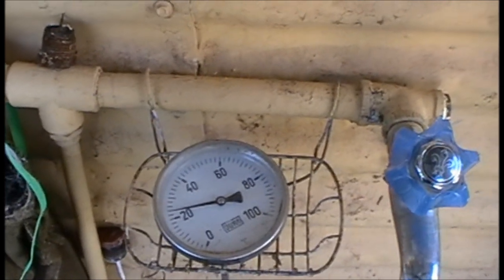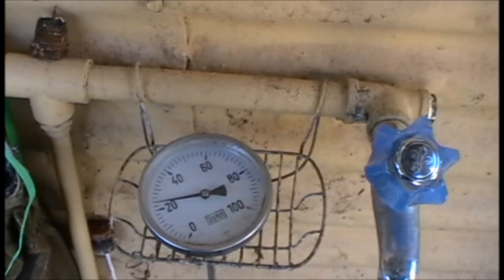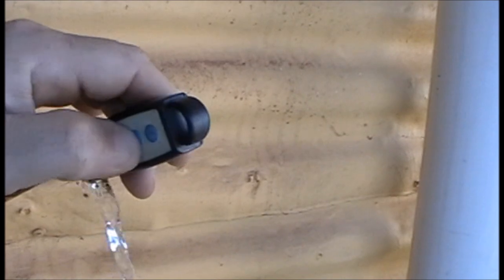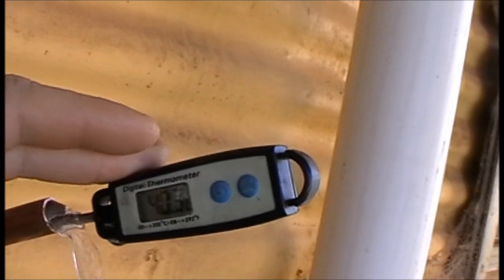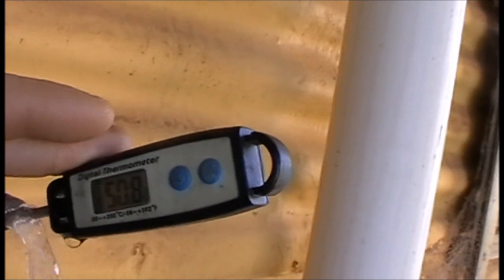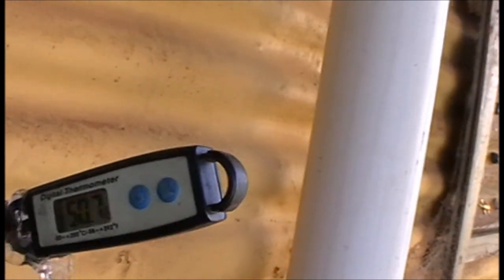Well as promised, we'll check the temperature. Ambient's just under 24 degrees. It's getting on in the afternoon — we've had about five hours of sunlight on the batch heater since we last checked the temperature. As you can see, it works fairly well. There's been no other draw-off of water from the tank since we last checked it, so it's essentially a static test. It's getting a bit too hot to touch that pipe — not too bad for five hours of sunlight.